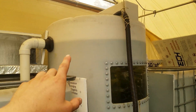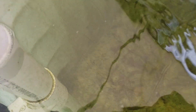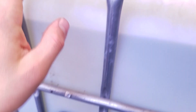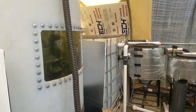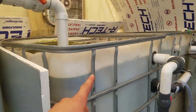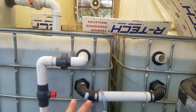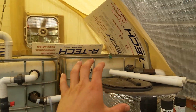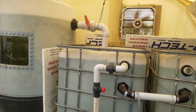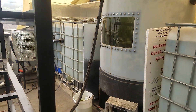The pipe goes in there and then overflows into these two tanks, and I have solid lifting overflows in here going down there. Connected via this pipe into here, and another solid lifting overflow goes from there into here — same thing on that side. I'll be changing most of this plumbing to make it more efficient. I'll basically have all these tanks on separate lines so if I wanted to turn one of them off or have one of them empty, I have that ability. Each of these will have water entering them separately from the pump.